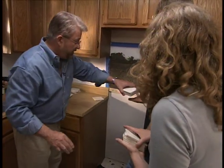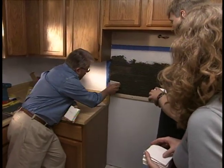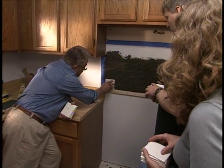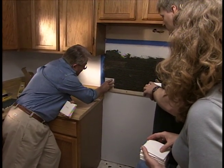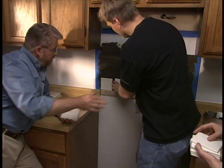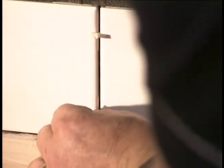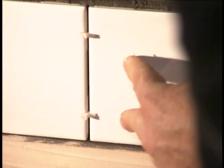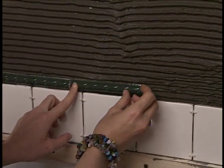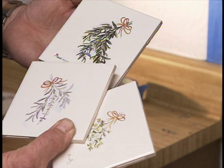After mixing the thinset mortar, Kimberly applies it with a wide putty knife. I follow with a notched trowel, which creates uniform ridges of mortar all the same height — this guarantees even mortar distribution on the back of each tile. Push the tile into the thinset and give it a little wiggle back and forth. Paul and Kimberly lay the first row, inserting temporary vinyl spacers between tiles to create an even grout joint. We'll remove the spacers once the mortar sets. To dress the backsplash up, we're also installing rope trim and decorative herb-motif tiles — rosemary, sage, and parsley — to satisfy Kimberly's eclectic taste, alternating decorative tiles with plain ones.